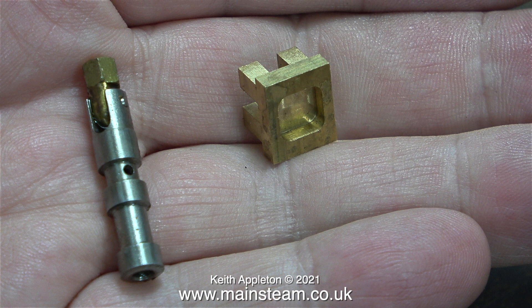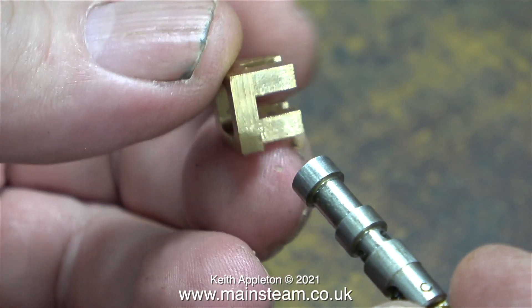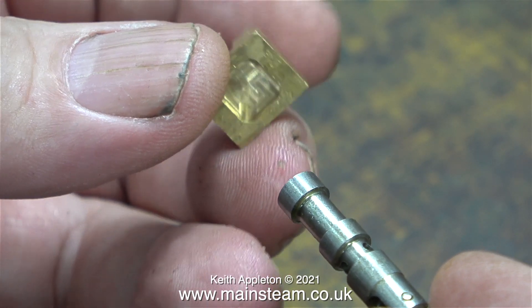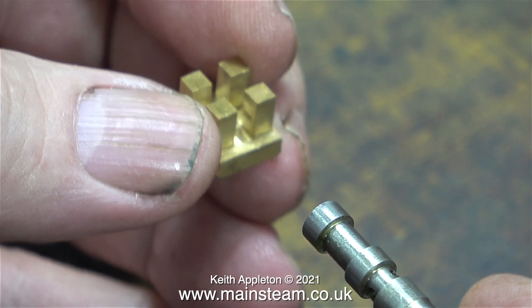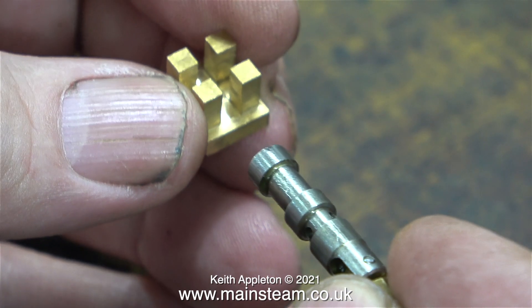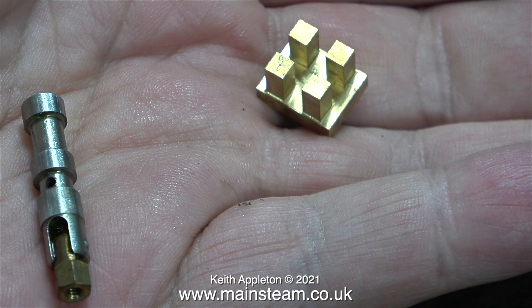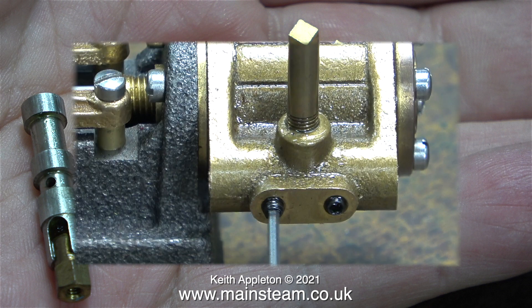In my hand I have two valves — one is the piston valve I've just shown and the other is a Stuart slide valve, and you can see how very different they are. A slide valve works differently: the pressure of steam holds it onto the port as it moves back and forth. A piston valve moves back and forth but there's no steam pressure on it, so it's a lot easier to move, meaning the valve gear doesn't need to be quite so strong and doesn't wear out as quickly. The well-known saying is that a slide valve wears in and a piston valve wears out — but what it doesn't mention is that as the slide valve wears in, the valve gear pins are wearing out because the steam pressure makes the slide valve much harder to move. A piston valve will wear out, particularly in a small model, so you just make another one slightly bigger.